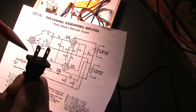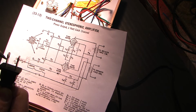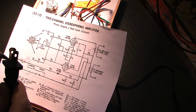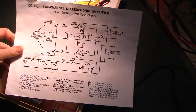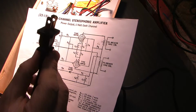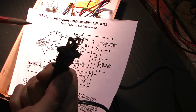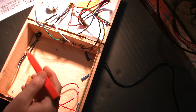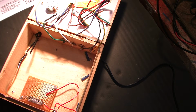If you were to touch the wires themselves, one of these is relatively safe, because it's referenced to earth ground back at the panel box, and the other one is hot. That's the one that's going to shock you. And I can tell you that the smaller of the two blades is the hot one, and the larger of the two is the grounded one, the safe one. So when you have two wires coming into your amp, you can't randomly pick which one you want to use to switch and to fuse.